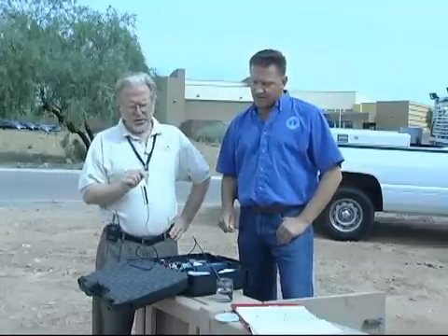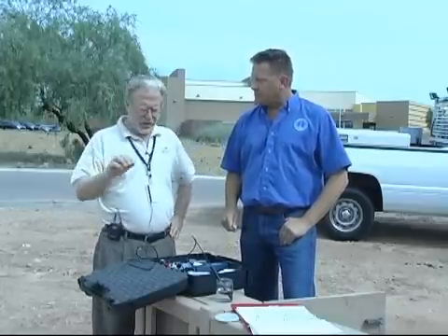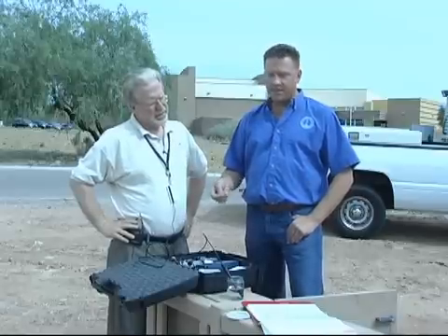So I saw you go over — you've already set up and you've already taken an initial sample. Why do you do that? Because we're establishing the baseline from the get-go so that you're able to ascertain the changing of the conductivity as you purge over time, and temperature and pH. The APP permit denotes that you purge three well volumes until it becomes stable. In our case, we automatically do three well volumes, but it still allows us to historically look back and see what the initial values were as well as the ambient.